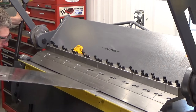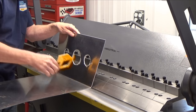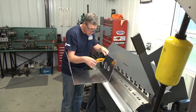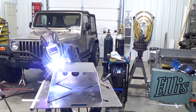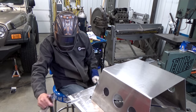Okay, it's time to bend these — I'm looking for about 78 degrees. This is the type of fitment I'm looking for on the weld joints; I'm not fully overlapping the side pieces. To help with tacking, I'm using a couple strips of duct tape to hold the seams together. Remove it quickly and use acetone to clean any tape residue.